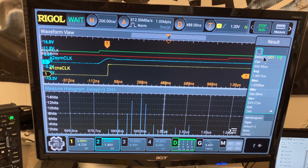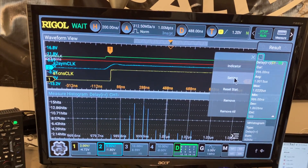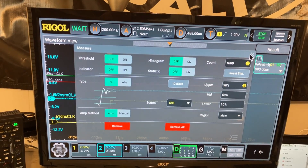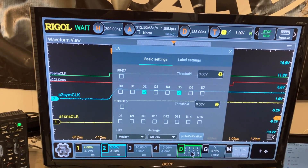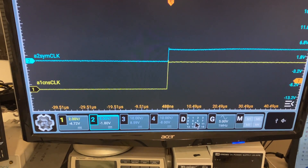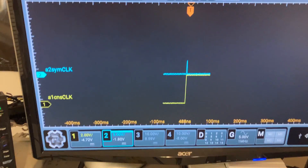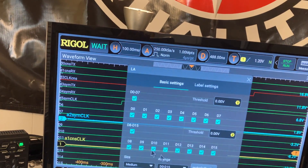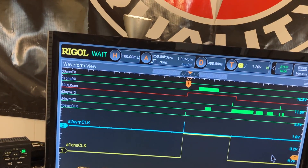The equivalent analyzers are available with the normal measurement parameters. Turn off the histogram and statistics to return to the normal display. We'll try something more interesting with timing and sampling on the next video. Remember: don't go beyond 100 milliseconds as a time base — that is the limit of the logic analysis. The scope will change behavior if you activate too much time due to memory constraints.